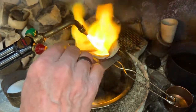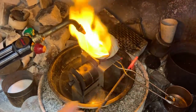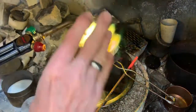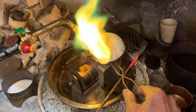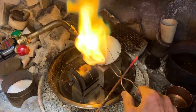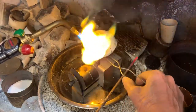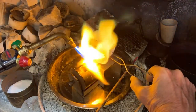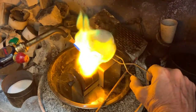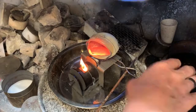Once you're sure the metal is completely molten, set down your graphite rod, grab a pinch of flux, throw the flux into the crucible mouth, and go ahead and pour the metal into your ingot mold or mold cavity, keeping the flame on the metal at all times. And that's it — it's pretty simple.